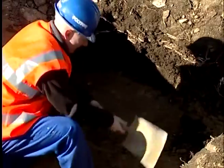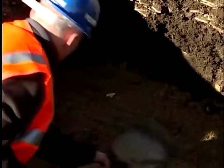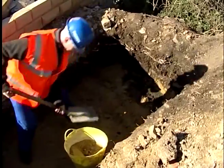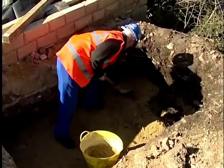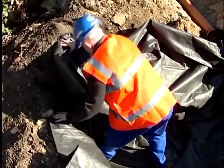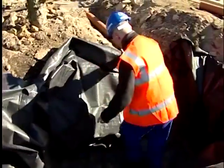Firstly, dig a trench for the pipe work from your rainwater outlets and a hole suitably sized for your soak-away. Lay a 100mm layer of coarse sand base to the trench and soak-away hole. Cover the base and sides of the soak-away hole with permeable geotextile membrane, allowing enough material to enclose the top of the units when installed.